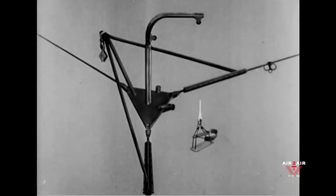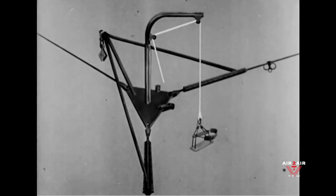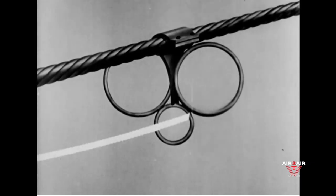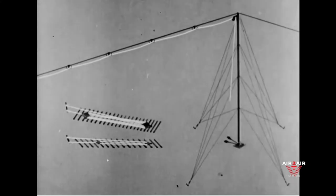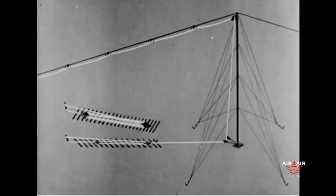The lifting line runs over sheaves on the davit and one at the triangular plate, then through triple-eyed fairleads, which are clamped along the bridle cable, back to a block at the masthead, down to and through a block at the base plate, and out to a snubbing post.